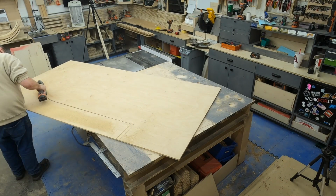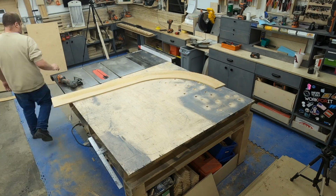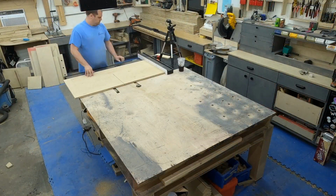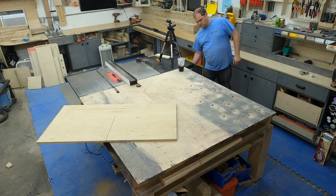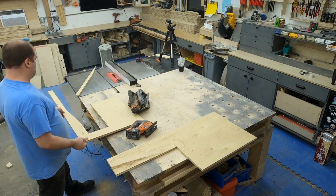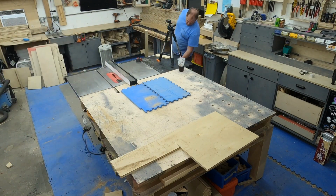What I'm doing here now is I'm actually taking a piece of 1/2-inch plywood and I'm cutting that bottom ramp. And you'll see where that goes here in just a second. But I started off with something that was roughly about 10 inches wide on one side and narrows down to 6 inches. I did later end up cutting back some of it just to make it a little easier to construct the supports. So, you just very quickly saw it there, but basically I cut in, I left it there long enough to show myself what I needed measurement-wise to cut the piece that I'm cutting now, which is ultimately going to help tie in and make this L or J-shaped module stronger.